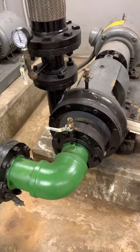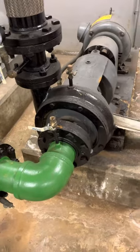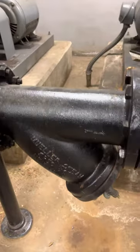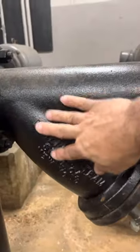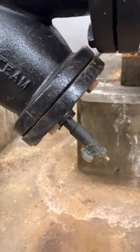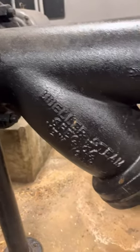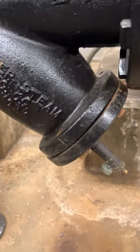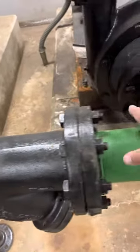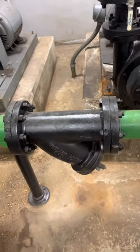Here's a video regarding two cooling towers. If you have high head pressure, go to your pump that's pumping the water to the cooling tower. Make sure your screen, which is inside this piece here, is drained regularly and checked if it's clogged. You either take it apart on a scheduled basis, or you can feel the temperature from one side to the other side with your hands on both sides, and determine if the temperature is the same.